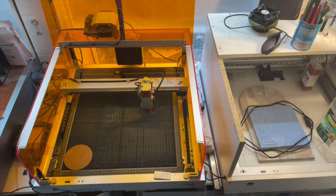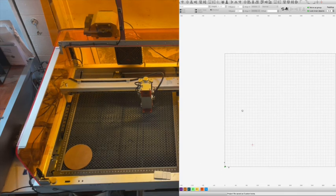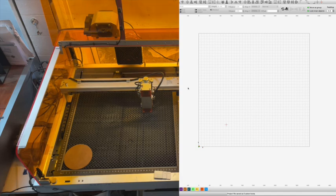So popping over to the computer, we have Lightburn open, and here I'm just going to quickly draw myself a circle. Circle, shift not space, and we'll lock that. We'll make it 99.5, enter. Nice little shortcut up the top here. We just hit that little corner section there and it pops it into the corner for us. Now we're going to make that just a background.